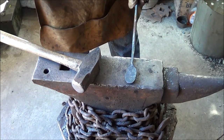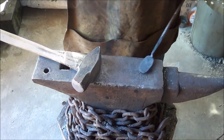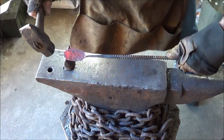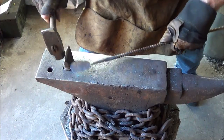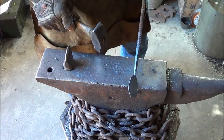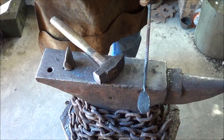It's just way too long, right? I either left too much steel or I didn't upset enough. Everything else I think I'm okay with, so I'm going to go ahead and just nip a little bit of that end off. A good smith shouldn't have to do that — I'll get there someday. I'll be completely honest with you: I like the longer poles, I'd actually probably leave this, but I just want you to see. Sometimes you have to accept there are certain things you're not good at, and I have no problem admitting that. The day I say, 'oh yeah, I learned everything I need to learn' — that's the last day I smith.